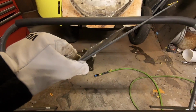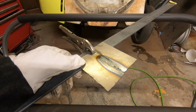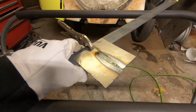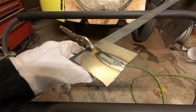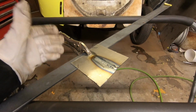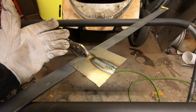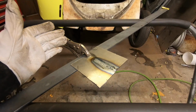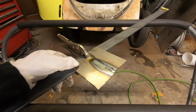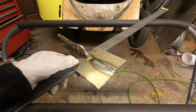I mean, this is thick. Maybe a truck floor would be made out of this. I'm pretty sure the wrecker body is 16 gauge, and that's thick. A VW I think hovers around 20 gauge. The Plymouth I think hovers around 18, and a new car is probably 22, 24. I mean, it's thin.